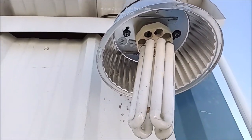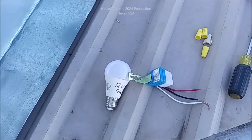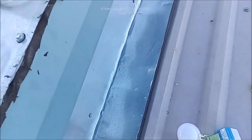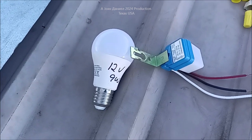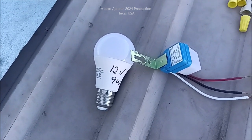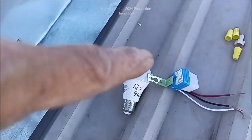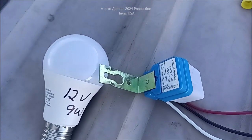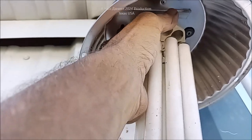I'm going to convert this to DC power, 12 volt, daylight to dark too. I'm going to be using a 9 watt 12 volt, which is about 75 watts of light — plenty. This is only about 16 feet off the ground, and a dusk till dawn switch. So the first thing is to get this out.